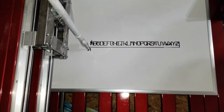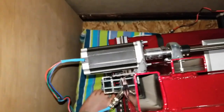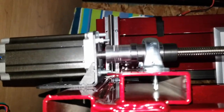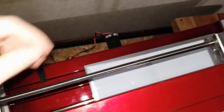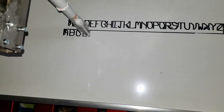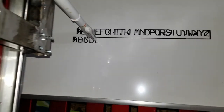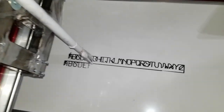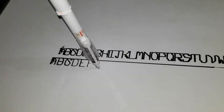Okay, so our project was a CNC machine which works using fancy electromagnets known as stepper motors, which take computer signals and then convert them into rotational energy, which when attached to a lead screw becomes linear motion, enabling us to use a coordinate-based system to draw out things. Most CNC machines use 3 axes, but due to Corona we were unable to implement our 3rd axis, so this is our little makeshift solution, which is slightly too far away to write.